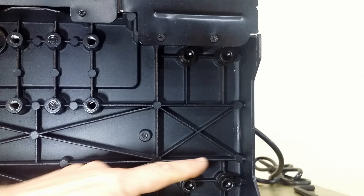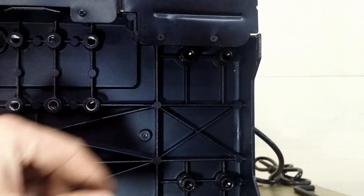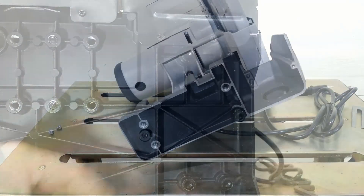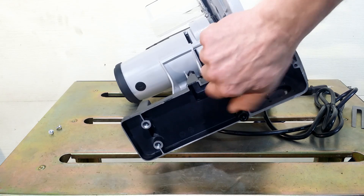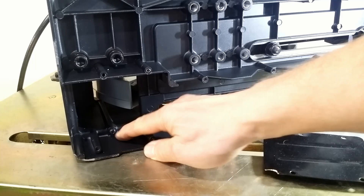The base is not one casting with the motor support. It can be detached by undoing four bolts and one small bolt next to the chip-catching opening. I had to remove the plate that holds the chip tray in place to access that small bolt.